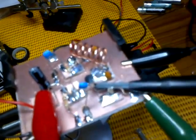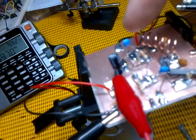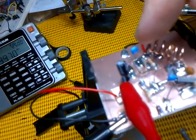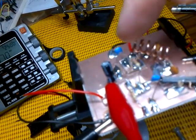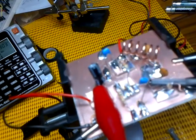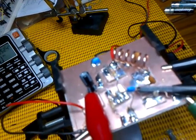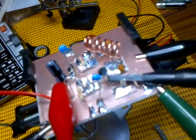I'm quite pleased that my adjustments have seemingly paid off. You can see here I've got these blue capacitors. Initially I used 103s — that's 10,000 picofarads — and these are 104s, which is 100,000 picofarads. So a slight adjustment to the units I was using. Otherwise, everything else is pretty standard from the existing circuit.